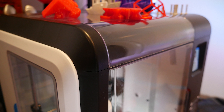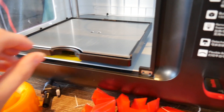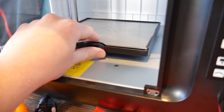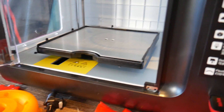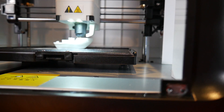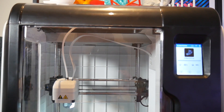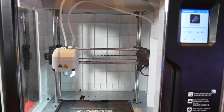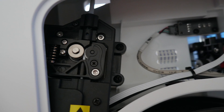Flashforge has clearly taken some design notes from consumer inkjet printers to cut costs while retaining functionality. The Y-axis, for example, only has one linear rod and an unsupported side which rides on a roller. It looks pretty dodgy and I'm not sure how long it's going to last, but print quality doesn't seem to be affected. Similarly, the gantry has Z-axis lead screws on both sides, but they're both slave to one motor with a belt to save weight and cost. Overall, a lot of effort has gone into the aesthetics and functionality, and Flashforge must be selling an awful lot to justify this much injection molding.